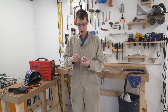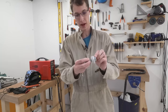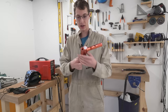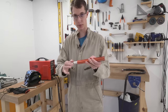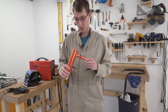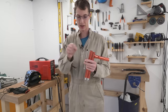Cool, I've got some welding to do now. The first thing I've got to weld is this here — it's the pulley I made. The string just runs straight through that groove, but I'm going to make something that will just surround the pulley to stop the string from unseating itself. And the second thing I'm going to make is the actual grappling hook itself. This here is the launcher we're going to use — we've scavenged it from another device. The idea is that you'll pull this back to prime it, release, and that opens the valve with a hammer action so all the air can flow out at once. I'm going to have to make a hook that can fit right into that barrel, and I've got some tubing for that job, and I'm going to scrounge up some extra steel to make the little fins.